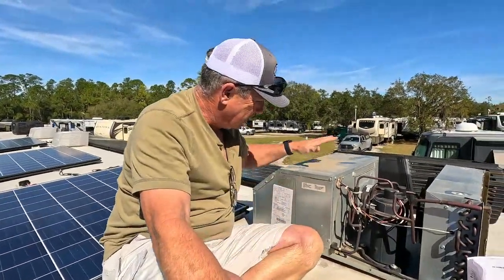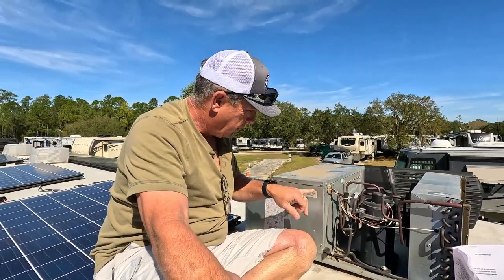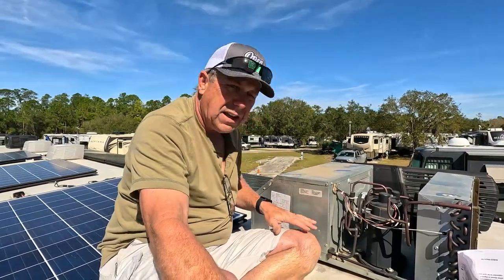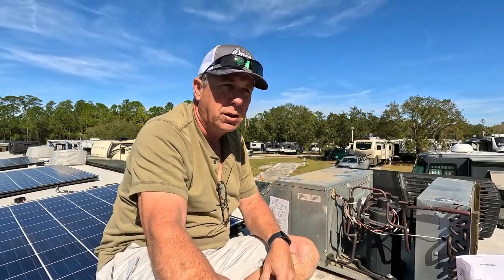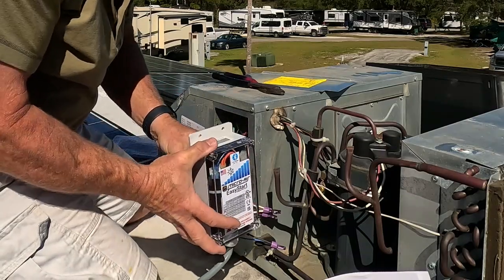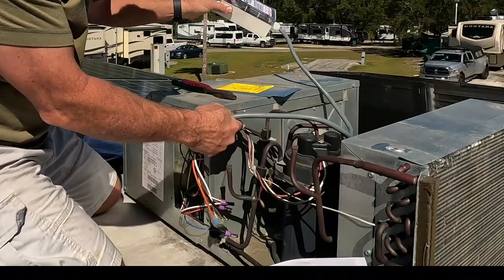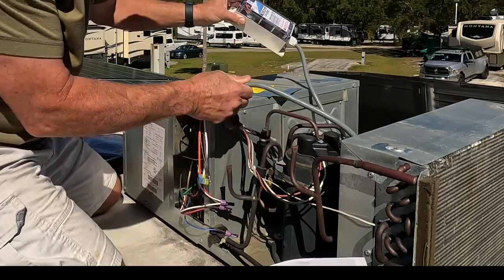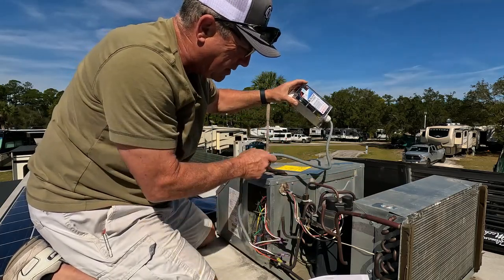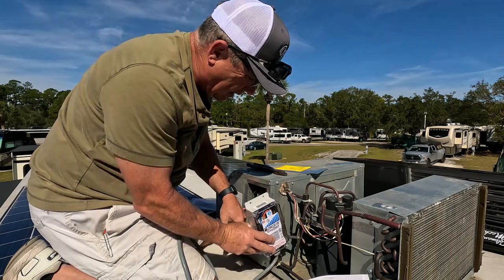Next, on this side of the AC unit, you're going to need to take this panel off. There should be a couple of screws right here. Spin that off and that'll give us access to the wiring inside and where we need to do our hookup. This is the soft start — we're going to need to find a place in here to mount this. It's got plenty of cord. You can mount it wherever, but the cord is going to need to come through this water slot right here so we can tie in to the rest of things. You definitely don't want to be in an area where it gets messed up with your fan.